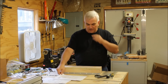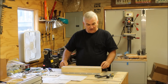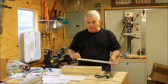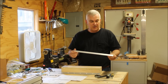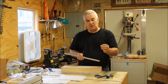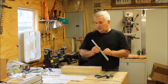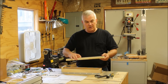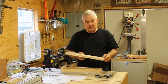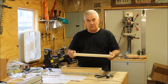I've got my assembly drawings right here. I've just got everything set, checking the fit and making sure everything is right. I've already cut a couple of angles off camera, laid out the holes, drilled them, and put a countersink in them. I'm going to use number 10 inch-and-a-quarter wood screws — that's what I made the countersink for. The first thing I need to do is drill the pilot holes for the screws, and then we'll get this thing assembled.